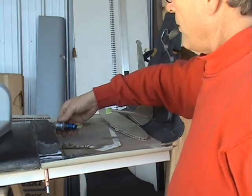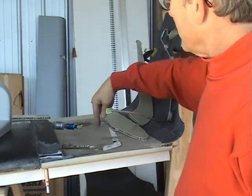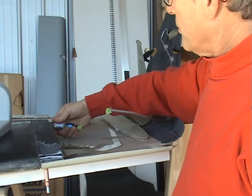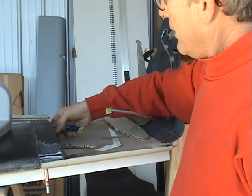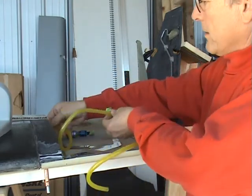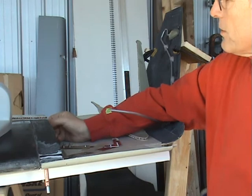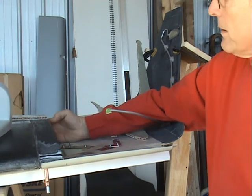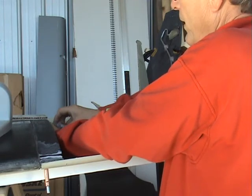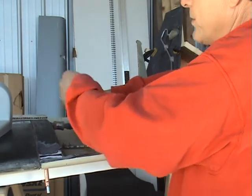And in doing that, you would get to keep this check valve, which is not normally used for the winglet, but it's used for the short wing to keep the fuel from leaking out. But I'd like to use it. Now the manual would show for just the winglet that this is just a tube coming out, and you would attach this to the tube here and this to this tube and put a couple aviation alligator type clamps. However, I'm noticing that this tube that's sticking out of here is not 1/4 inch like it has been in the plans. So this wing was fast built in the factory, so cutting that off is not so much of an option.